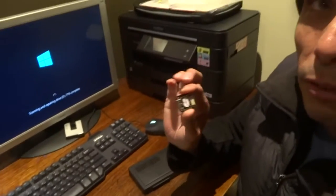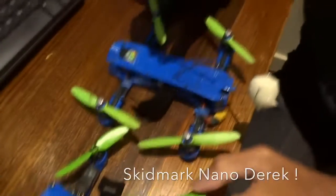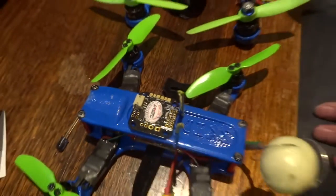We are building something around this sucker. Originally we were thinking of this guy — the Skidmark Pico — and that's the Skidmark Nano. The problem with the Nano is that with the Flip 32 board in it, it has no telemetry; you had to put in some inverter and it was too much stuff. And it was only an F1 board. This is F3 — very nice.